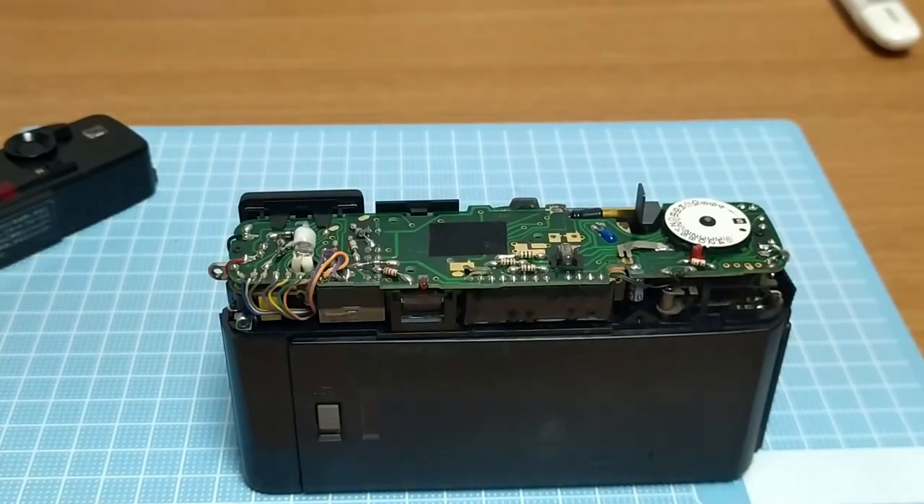If you want, you can actually leave it hooked up while you do your work and take it off when you've finished your job. That might be good if you actually want to try energisation while still working on it with it open - you can just unhook a probe to see if it works and then hook it back on to discharge and away you go. So the first step will be to make the discharge tool, the second will be to pull that top PCB as clear as we can and then remove that capacitor. I'm not sure exactly how easy that's going to be to get out - because of the corrosion on one of those legs we probably need to re-solder that back on, get some more solder in there, and then the pump will probably be able to pull it out quite easily.